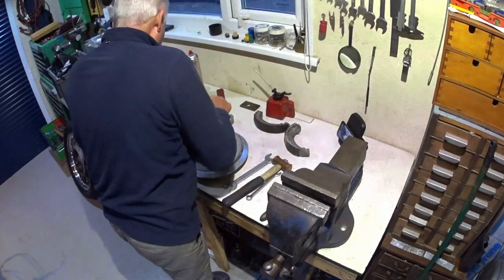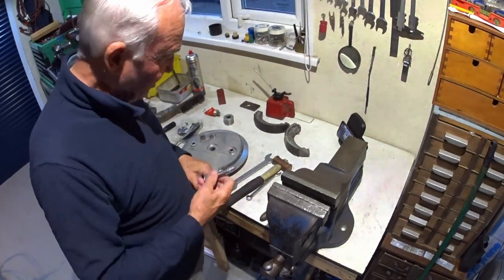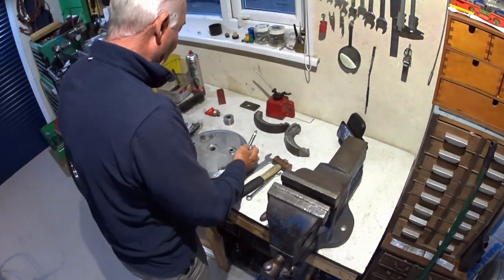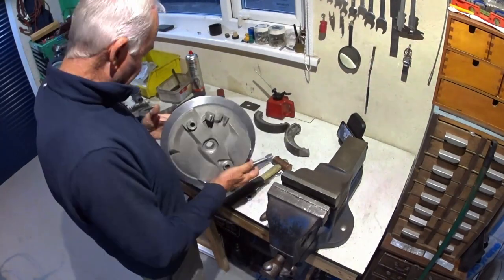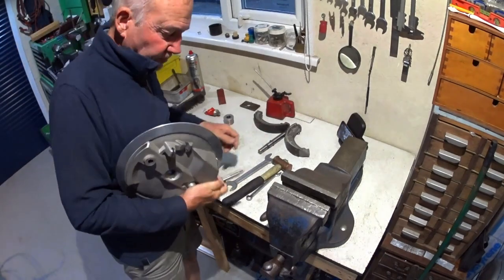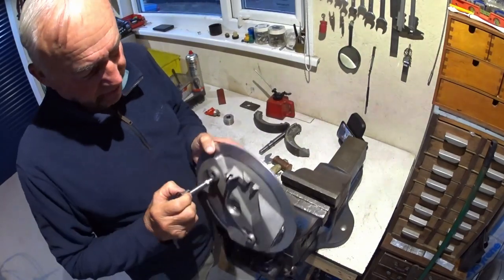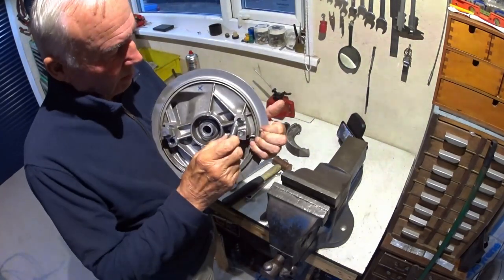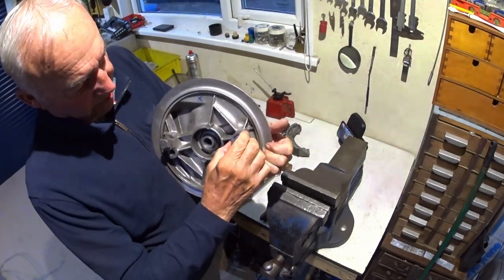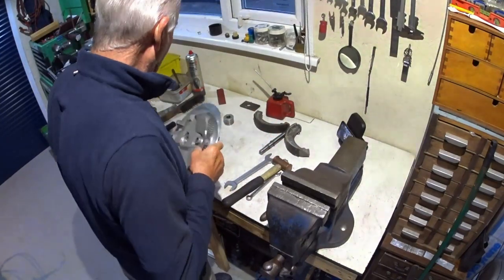So just looking back at the other stuff — the cams, the shafts were good. There's hardly any wear on the shafts, so very very little use. But the grease had gone rock hard and these were really tight. They're lovely now. I'll probably just put copper slip on these going back. So they're all good and obviously the wheel's fine.